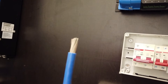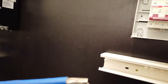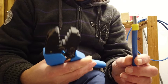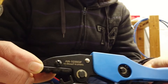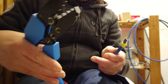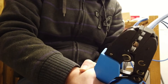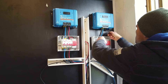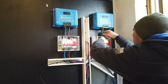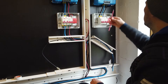Here I'm ready to make my first cable for the solar system — the DC cable, 25 square millimeter. Remove two centimeters of the insulation, then add one of these end wire connectors, and crimp the connector on the cable with this tool. It's marked here for 10, 16, 25 and 35 square millimeter. I use the 25 setting and it's working pretty well.